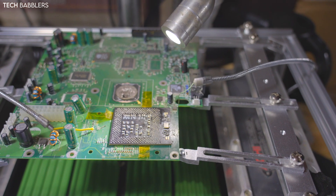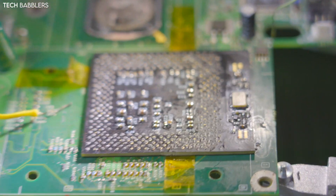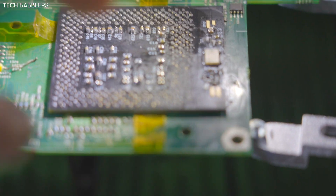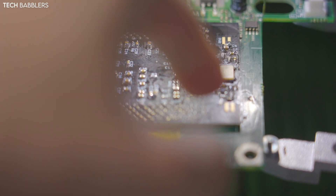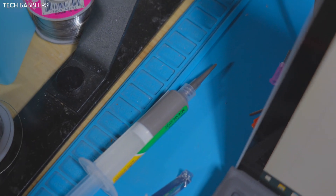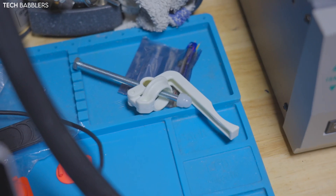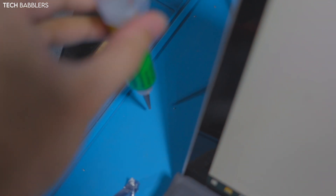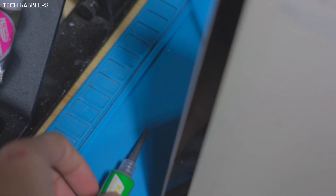Several days later. Alrighty, so it's been two days. I got my final parts in — as you can see, we've got solder paste on every single pad. I was missing the oscillator, voltage regulator, and resistors, which I've now put on. The way I applied the paste — I kept it in the tube, used this tip, and basically pressed straight down with small little presses every few pads. It kinda did well. Anywhere I got stuck, I cleaned it up and redid it.